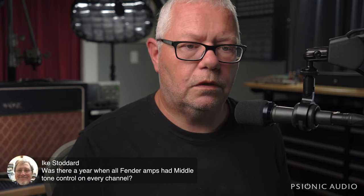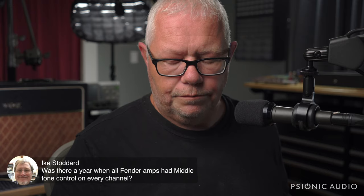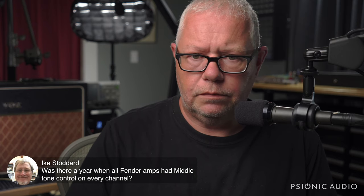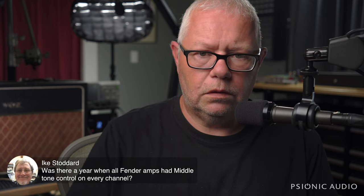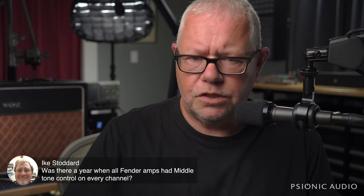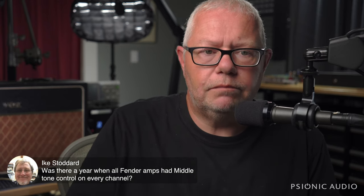Hey, Emilio Navarre. Ike Stoddard, no, the mid-tone control is only on both channels on the Twin and the Showman, because that's how they designated it as the top of the line. The Super would not have the mids on the normal channel. The Pro would not have mids on either channel. Just little things that they did to make each model slightly different. They're all the same circuit, pretty much, just with different permutations. And that was the permutation that Fender did on the Showman and the Twin. Both channels got a mid control.